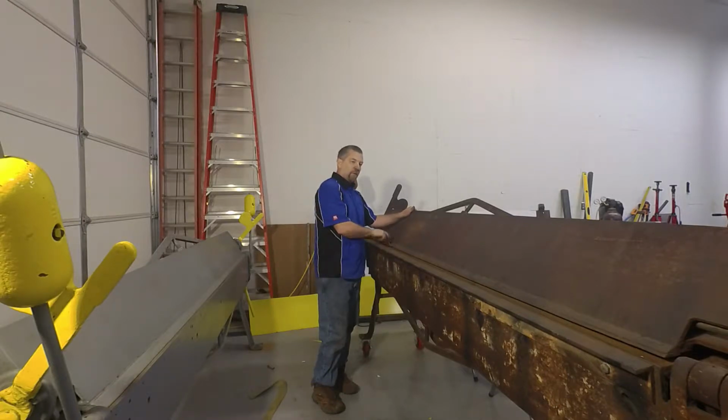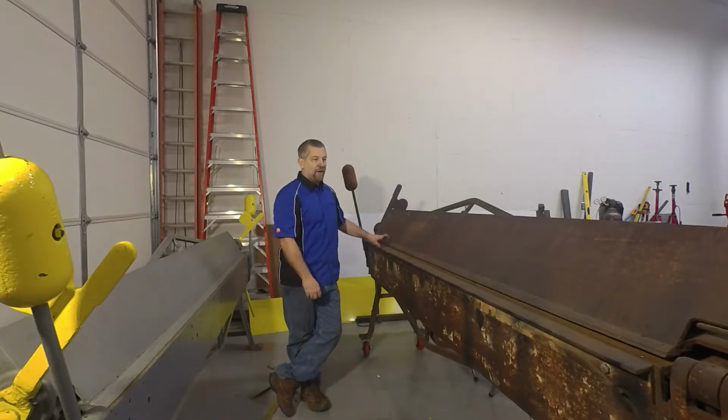And there's 34 bolts in all that bolt this nose onto this top piece. They're flathead and they come up from the bottom. It looks like the way they're exposed up here, water or whatever can get down in there, and those bolts could be rusted. So if you have to drill those out or you have problems with those, I'm going to say you're probably going to spend the better part of a day, if not more, just changing the blade out. So account for that, adjust that in your price, or get them to fix it for you if they try to tell you it's not a big deal.